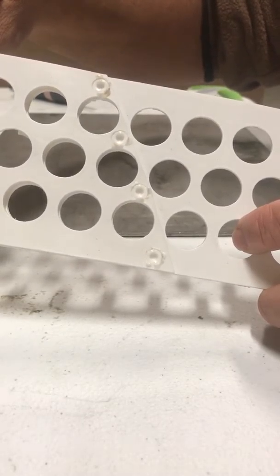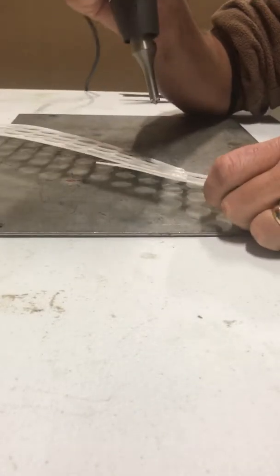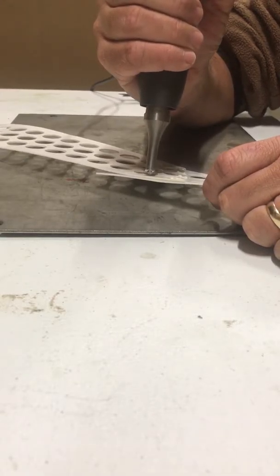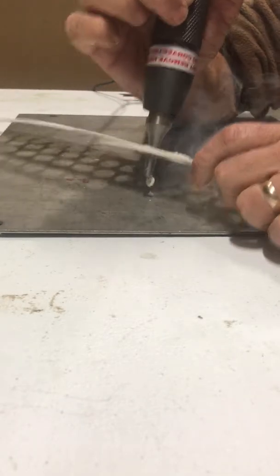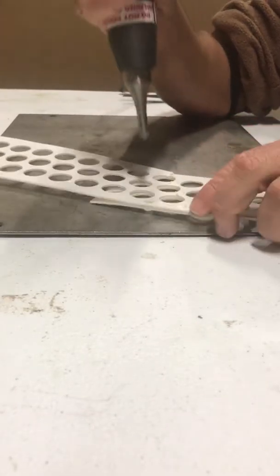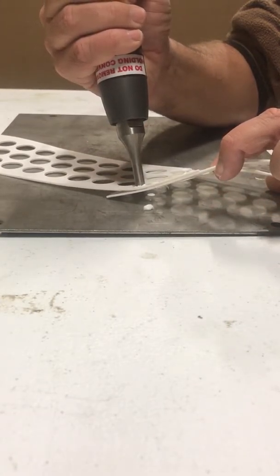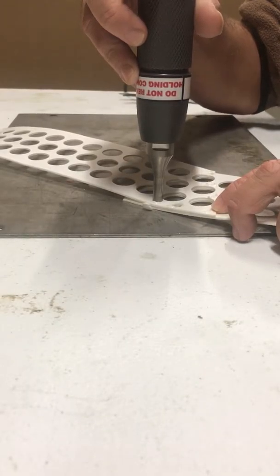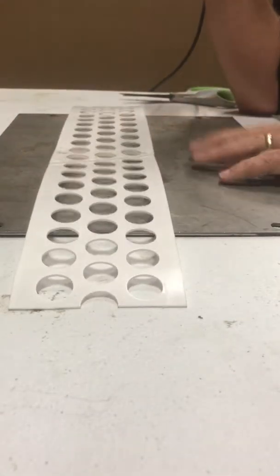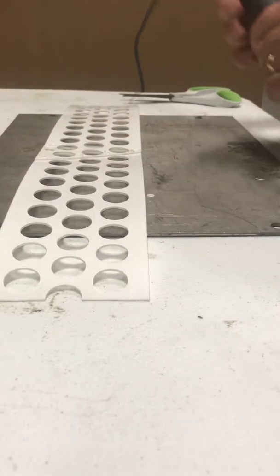If you do this and you're not on a solid surface, when you activate the welder and it starts to sink, it doesn't have a solid surface behind it and it will go completely through the belt. You do not want a hole in the belt — even if you release it, you've gone too deep and you don't have a good weld. The most important thing is a solid metal surface behind your weld.